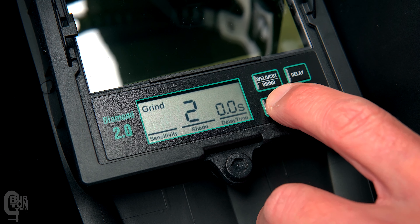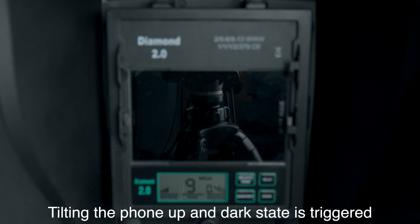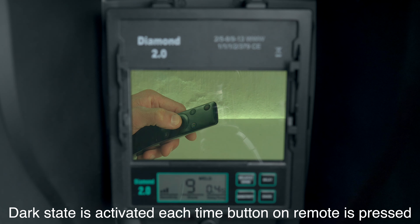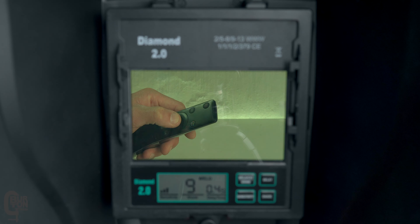Maybe there's a workaround — you could possibly set the sensitivity to the lowest setting when you finish with the helmet. Are we really going to do this? Probably not. Another workaround: maybe set the helmet to the grinding function when you finish using it so that it doesn't auto-darken. Also not going to work, because within a 24-hour period — I did try this — it defaults back to the weld function. Also, IR light, like infrared light, will also trigger the dark mode to come on. So if you've hung your helmet on a hook in the background, something in your workshop may trigger the lens to jump between light and dark state all the time, and eventually your battery runs flat.